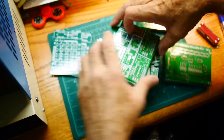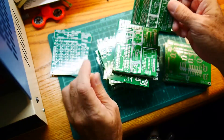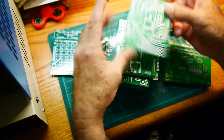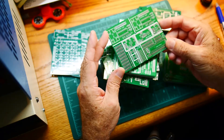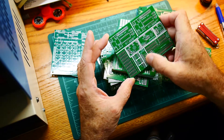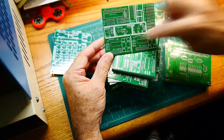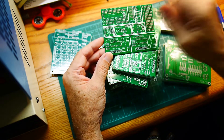I have a bunch of projects I've done in the past. Here are my Kim Uno boards. These are the type of boards I like to do where I use Eagle PCB, which allows you to do an 80 by 100 millimeter board. I separate them with some fat silkscreen, and then I have a bandsaw in the garage and I can bandsaw these up and make individual boards. The board costs me a dollar and I get all these little individual boards.